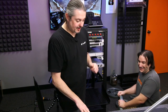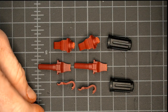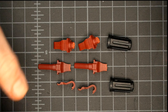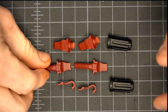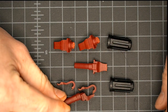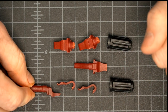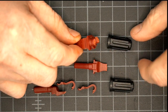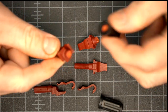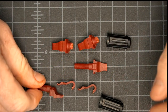I honestly thought the thread portion would fail — that just the black cap would slide off the threads — but it did not. It breaks in a different spot. The less-than-scientific conclusion is that these will handle 85 pounds as distributed in the center of that rack shelf. Both bottom ones pulled out and snapped — pretty much identical. You can barely tell which broken piece goes to which stud; they broke in exactly the same spot. There's some solid product consistency — they sheared the same distance.